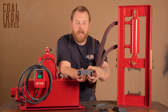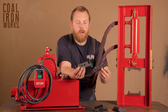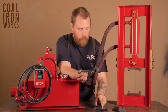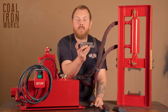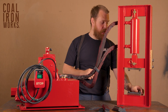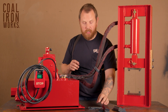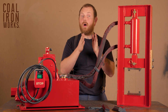These are an inch and a half by three inches of usable working space. And if you get the blank die set, you have the ability to weld on — you can see how we just weld the H13 onto these before heat treat, so you can make your own dies. These slots allow you to simply slide in and lock in place, or slide out your die sets. You just have a three by one and a half inch usable space on that die plate.